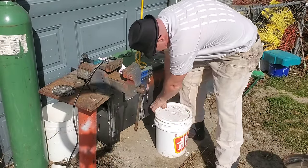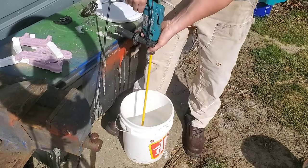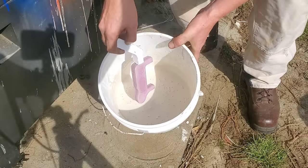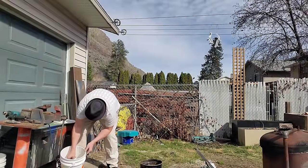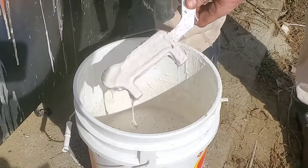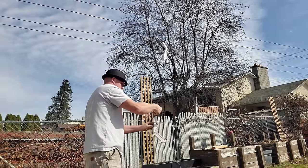The next ingredient, although it's not really necessary, is some drywall mud that's cut down with some water. It's basically cut down to give you a bit more consistency, and if you leave it sit too long like I did, it's going to settle to the bottom. So we're just going to mix it up very gingerly and dip this part in this slurry. One of the challenges when dipping it in the slurry is little air bubbles that get entrained in it — that's where the blower comes in. By blowing on the surface, it'll expose those little tiny air bubbles, and then you can re-dip it again and double check.